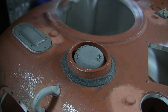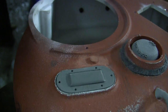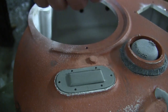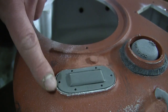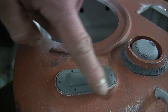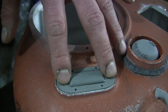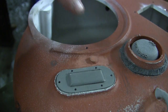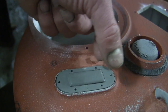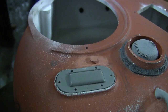As for the gunner scope insert itself, this is another recent addition to the ECA product line. To add this component, rather than using the Armortek one, the piece fits very well. However, some hand fitting with a Dremel is required around the molded-in tub in order to get the piece to fit in a better format compared to just leaving it raw. Now, the component still has some fastener detailing to be added, as well as a distinctive British pattern brush guard which we'll fabricate out of brass rod, which will be added in the next upcoming video.